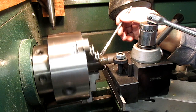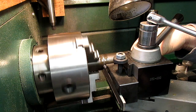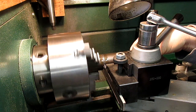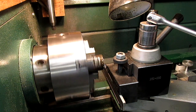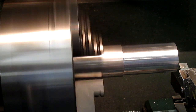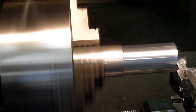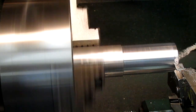The first thing to do was to cut the tube to length. I used a cutoff tool on the lathe to get a nice straight cut. The next step was to turn down enough aluminum shafting to cut a piston and the cylinder head out of. I had to trim it down to the OD of the tubing.